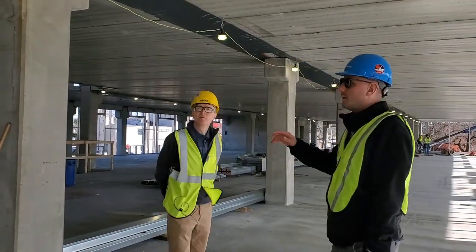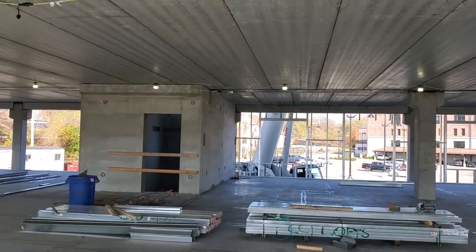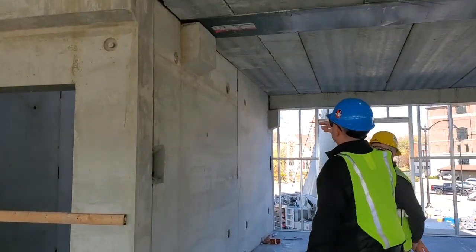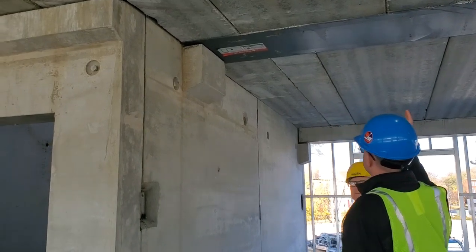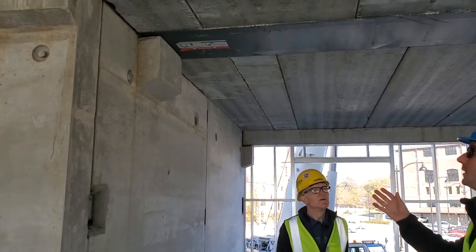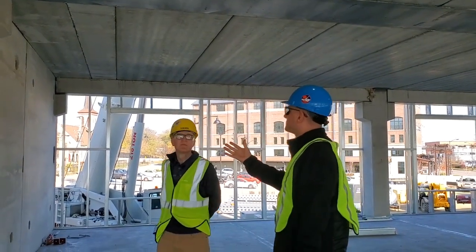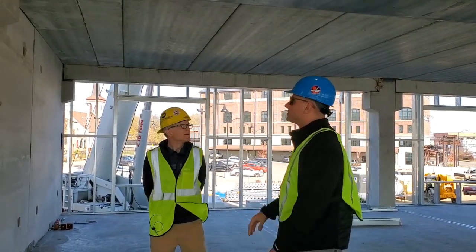And here we can see there are some precast stair shafts. That's right, yeah. Over there. We can see a similar haunch design to that of the columns, again done out of precast with a similar bolted connection. And so the delta beam does not discriminate on what it can connect to. So we see precast beams over there, we see precast wall panels, structural, can really connect to anything, steel columns along with hollow cores as well.